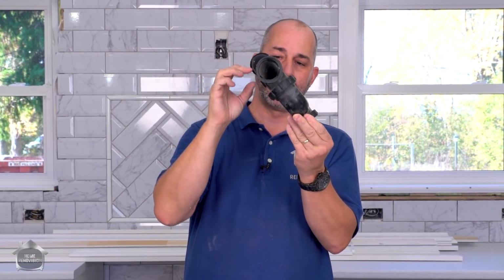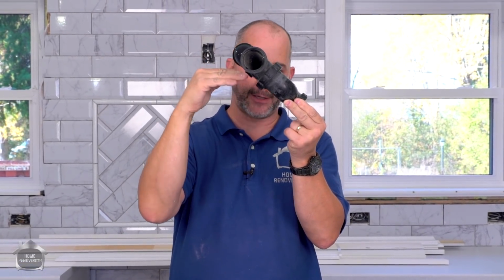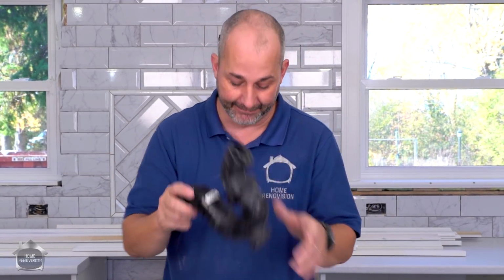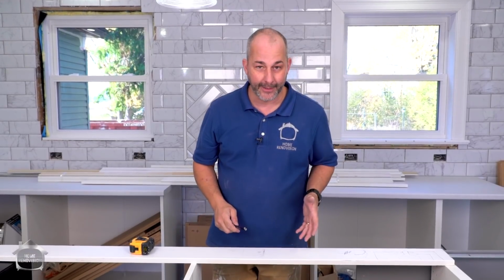The goal here is to keep the water line so that air can't pass through the pipe. And if it's on an angle, it still passes code inspection because the P-trap itself is still full of water. So that's an option for you. You don't necessarily have to have all of that contraption in your sink cavity. You can just connect them, run a pipe down to the back corner, and then put this in the ceiling downstairs.